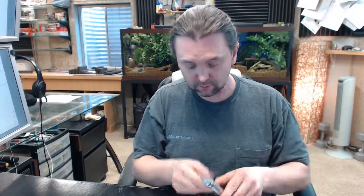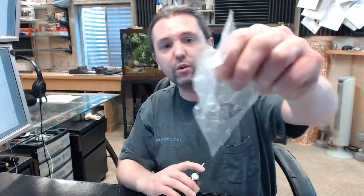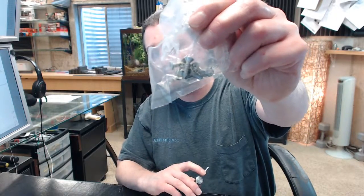And that's how you go about setting the tension. Put a pin into the first hole, test your door operation. Likely very little will happen. Set it again. Test it. Do that to both hinges, or all 3, or the one that you've installed. And continue to test your operation so that you get the performance out of it that you are looking for. Screws are included, by the way, in a complimentary finish.